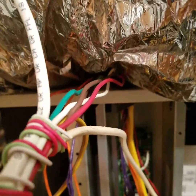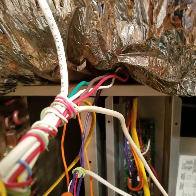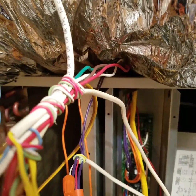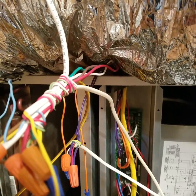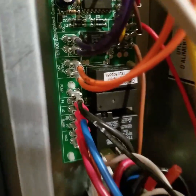That comes back and connects to the brown wire, which is coming right out of the top of the air handler. The brown and the red come off the transformer, which is right down in here. The other wires coming from the thermostat: the green, which is the fan, connects green to green going into the air handler. The white does the same thing — it goes from the thermostat up, white to white up here.